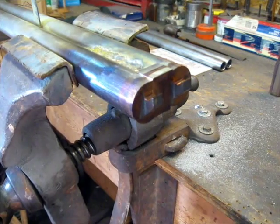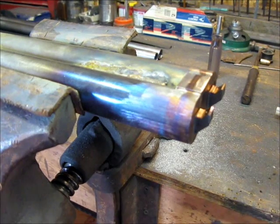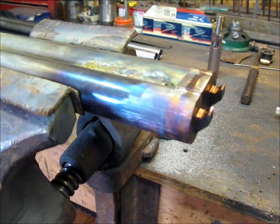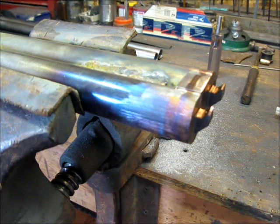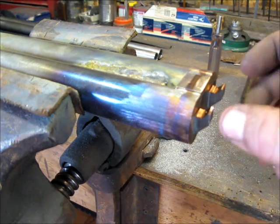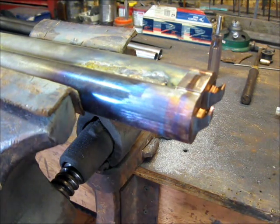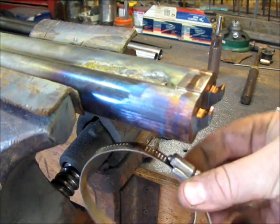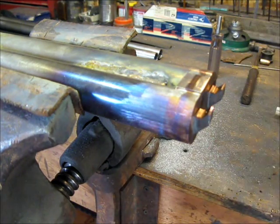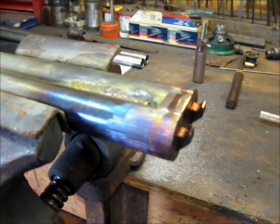You can see there are quite a few file marks here that will have to be cleaned up and polished down. That's one of the reasons I didn't worry about polishing the barrels when I was first turning them. Since I had everything shaped and contoured properly, the next thing I did was put it all together — got it all lined up so the hooks are perfectly aligned, everything in line the way it's supposed to be — and I used pipe clamps to hold it together.